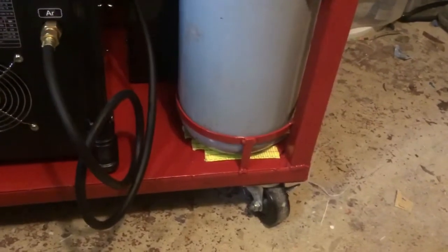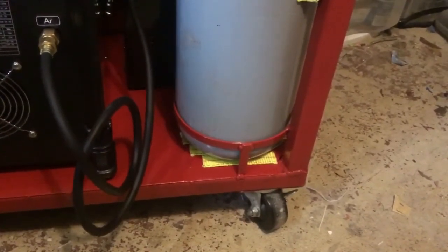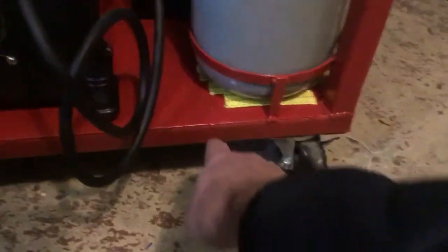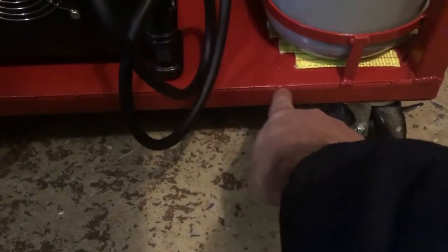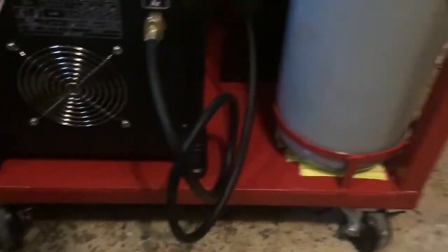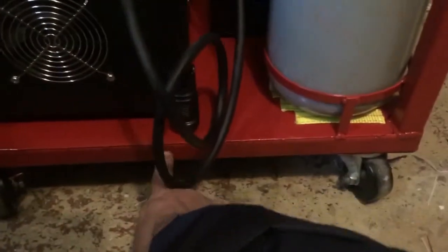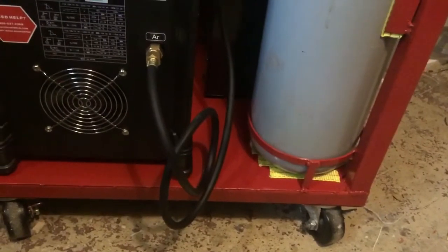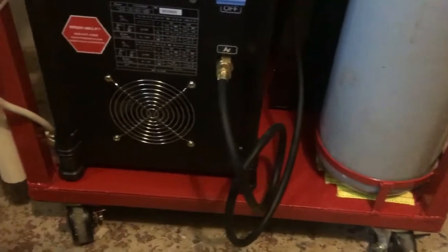The floor of this welder, I think, is, what was that, 16? Not 16 gauge. Maybe 11 gauge. I forget exactly. And it's just tacked every 3 or 4 inches or so. Just got a little tack here, a little tack. So I just got tacks on there all the way around. Also, on the bottom, running from this end to the forward end, is a piece of angle iron that I just welded in place.